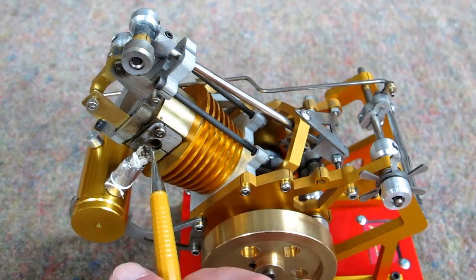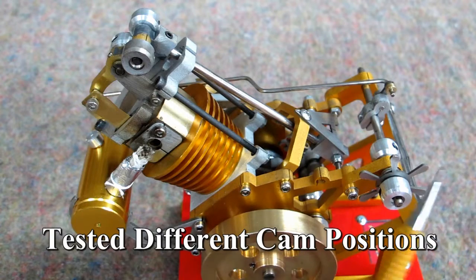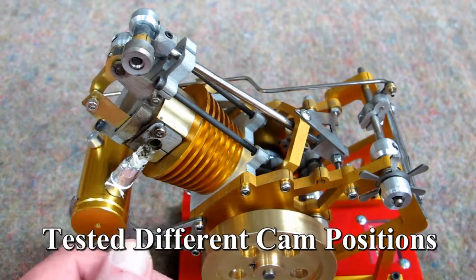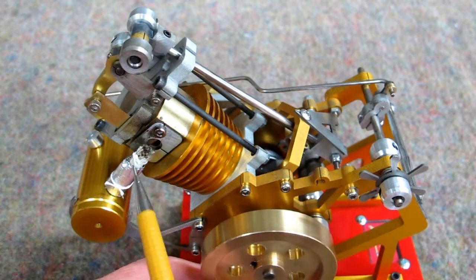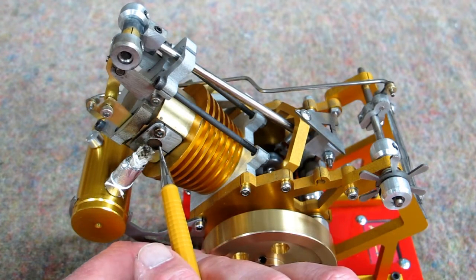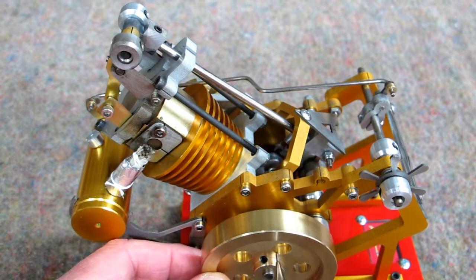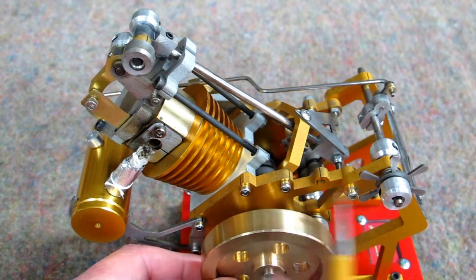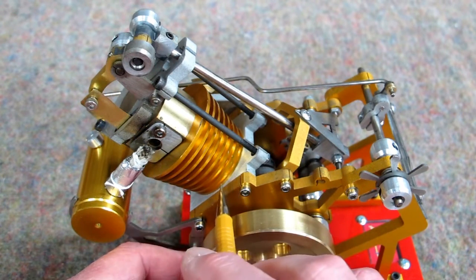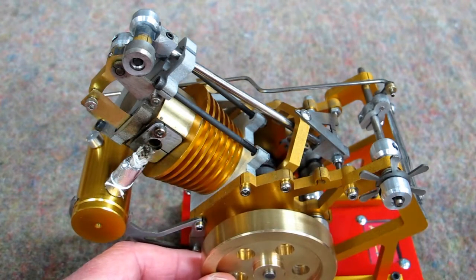When I got this, the engine was backfiring, spitting, and popping. I tried about 15 to 20 different positions. The best one I found is that the reed valve will be completely closed when the crankshaft is 30 degrees before bottom dead center. Due to the cam design, it will automatically be fully open before the piston gets all the way up, and it will exhaust what is above the piston.